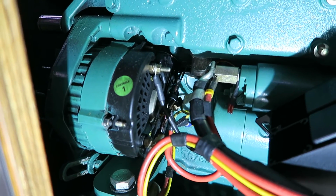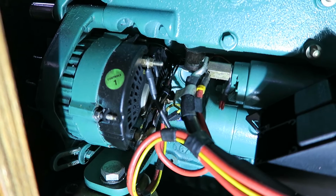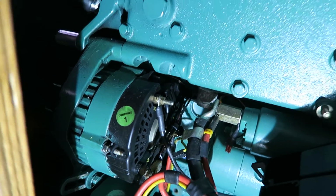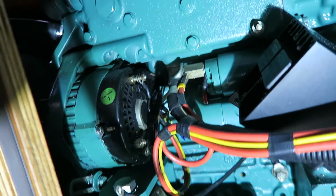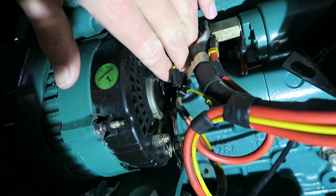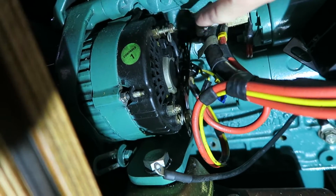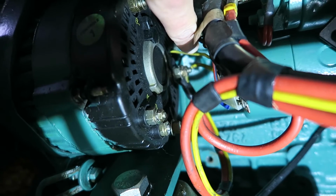The way I do that is of course cutting off all the power to the electrical system, and then I will remove all the cords that are connected, and I will then remove the generator by screwing off this top bolt and the bolt in the bottom there. First I disconnected the yellow wire directly from the generator, and then I disconnected the 3 cords here on the generator, and when they are removed, I can then reach the wire in the bottom there and disconnect that.